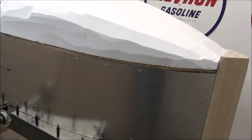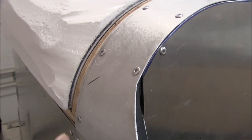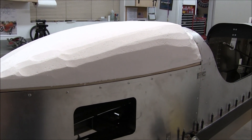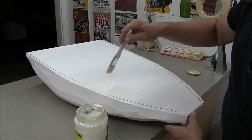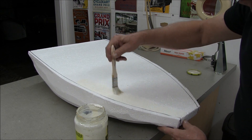You can see that it's starting to take shape. I wanted to get close but not too close, and I got pretty close right there but I'm still okay. There's still quite a bit of material to take down. I have it marked on the underside for locating it, so I'll glue it down pretty quick. Next I'm going to glue the foam block onto the plywood base using a water-based contact cement — it's nice stuff, we use it in cabinet building, it won't eat the foam, and you can let it sit and dry for an hour or two. Very forgiving, and then it'll still grab when you go to stick it together.